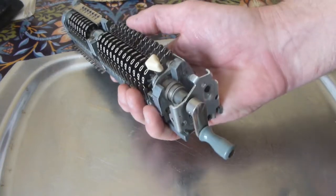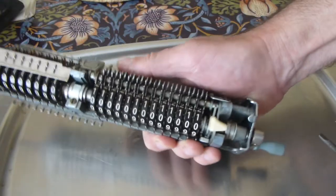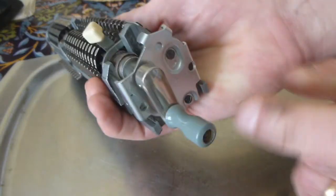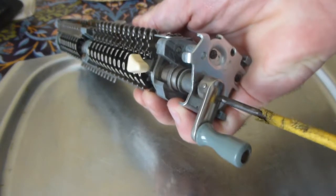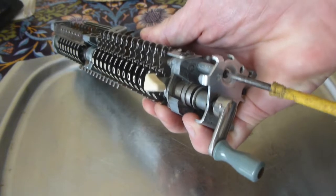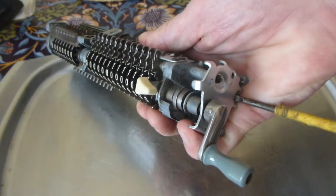Okay, to remove the resetting crank from the result register, first of all, if we take the carriage out of the machine and take the covers off, then there's three screws here, here, and here. Take those out. The plate here acts against quite a strong spring, so as the pressure is released, the plate will come towards you.